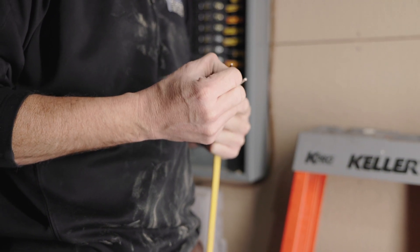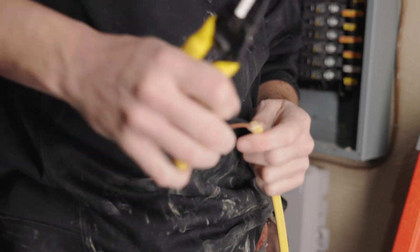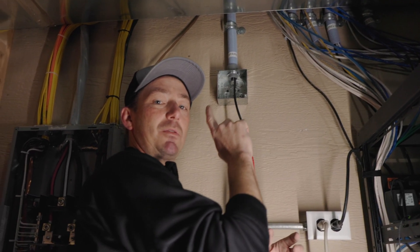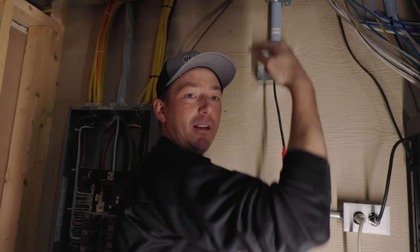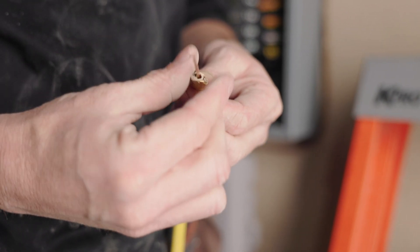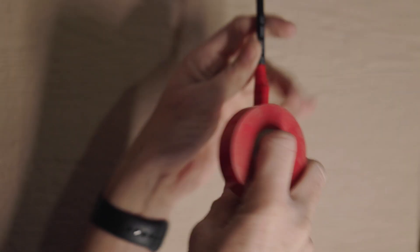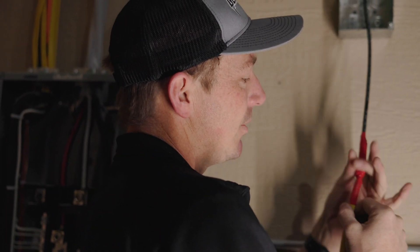I'm preparing this wire to be tied onto. There's a cable wire in that conduit that goes up to the attic. That's something not normal in most houses — this conduit going from the basement all the way to the attic. A lot of times we'd have to drill a hole in the basement and go up to the attic, drill a hole from the top down, then fish a wire. It takes a lot more time, but this conduit is very uncommon. Notice I cut those angles on that wire — that'll help it not catch on anything when I tape this up.